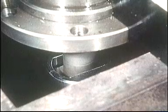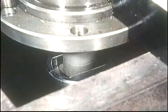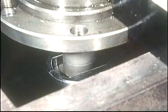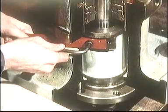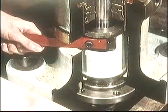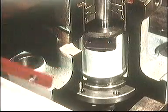When the plunger is in position, the regulating guide is turned so that the tool arm touches the left-hand side of the cutout in the pump housing, whereby the plunger is locked in the bayonet joint of the roller guide. Take off the tool arm, fit the regulating arm, and dismantle the lifting tool.